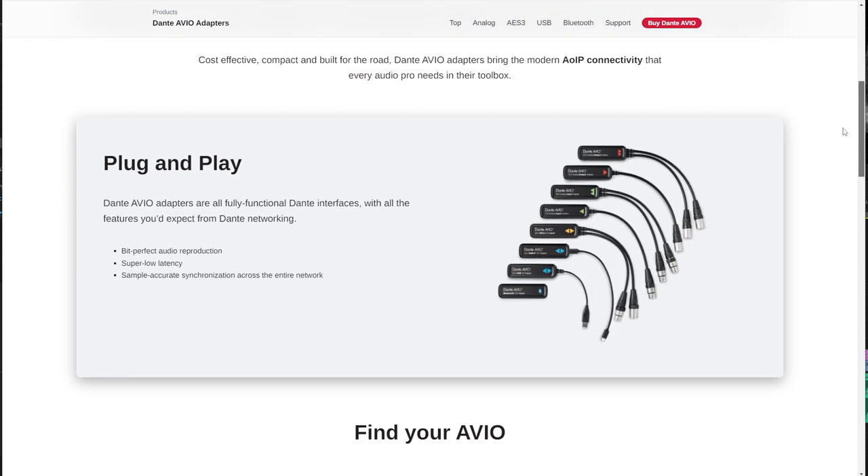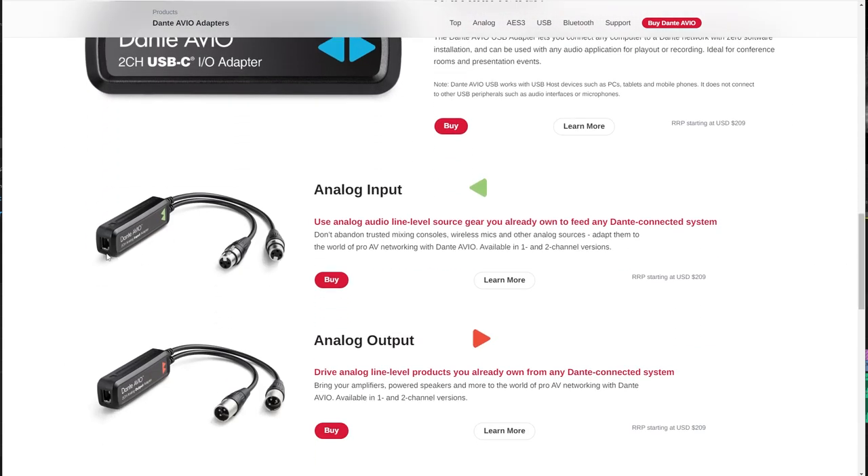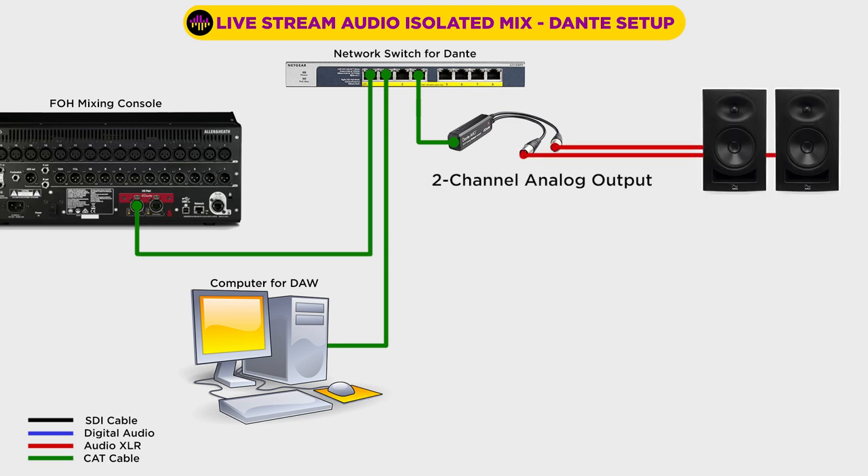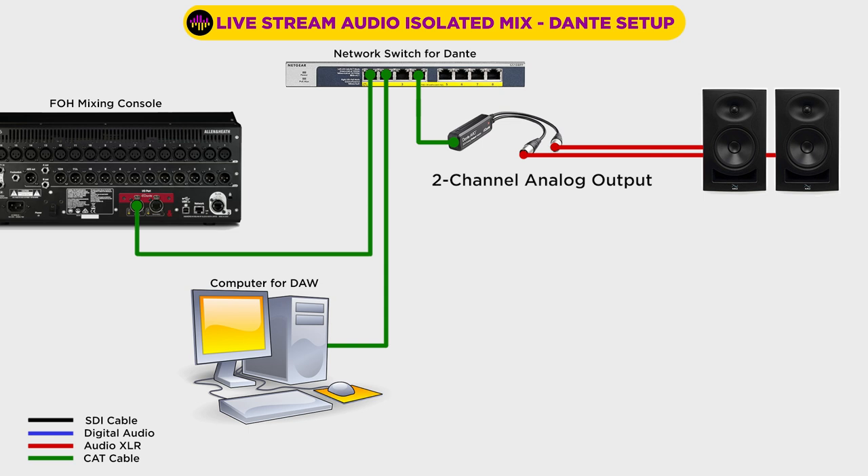When we get to the next video and set up Reaper, which is the DAW that we'll be using, I'll talk more about how you can check your CPU usage and be sure you won't get any dropouts or glitches in your audio. So if these videos are helpful, be sure and subscribe so you won't miss that. The next thing we'll need in our system is a way to monitor our audio from the DAW for our operator to hear what we're actually mixing. To do that, we'll use these AVIO devices from Audinate. They have a CAT connection on one side to connect to your Dante network switch, and then some form of audio input or output on the other side depending which model you get. These are the devices that require PoE power from our switch. For monitoring, we'll use the two-channel analog output version, and that output can be connected directly to your monitor speakers with XLR cables.